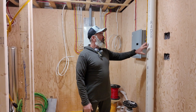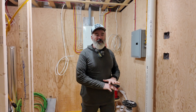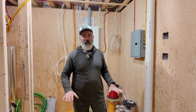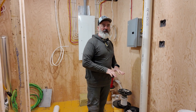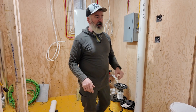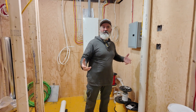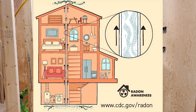We all know water is the killer of buildings. Radon is the killer of people. This 4-inch pipe is our radon pipe. We're basically passively depressurizing the entire under-slab of this lower level. There's a 4-inch perforated pipe that travels out, goes through the footing over there, tees off around here, and basically it's passively pulling air from underneath the slab straight up through the roof.